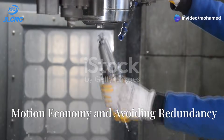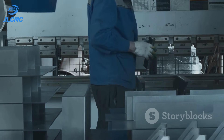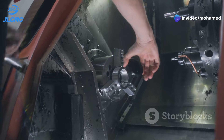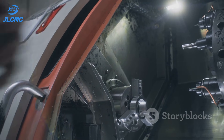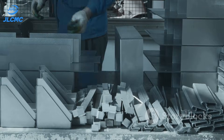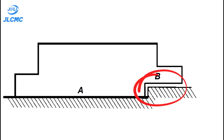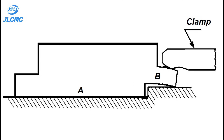The next two principles are motion economy and redundancy. Motion economy is about eliminating unnecessary movements and keeping your workflow smooth and streamlined — work smarter, not harder. Avoid redundant locators. For the depicted workpiece, locating can only be effectively done on surface A or B. While both surfaces are machined, the distance between them varies due to process capability. Using both surfaces A and B results in redundancy since either surface alone suffices. If the distance between A and B is greater than nominal, there would be clearance between the locator and surface B, causing the workpiece to bend when clamped. When released, the distorted part springs back, causing dimensional and form errors.